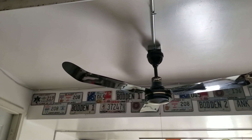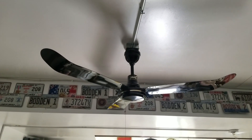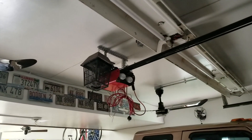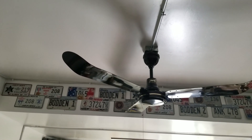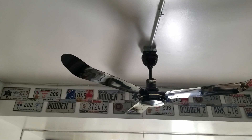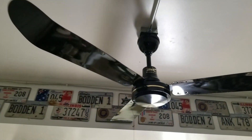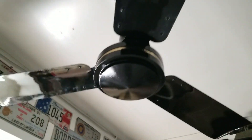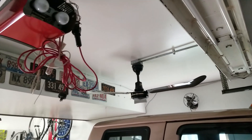I had to do quite a bit of work. What happened is they were left outside and the motors filled with water. One of them didn't fill up all the way — it had a little water in the bottom, so the bottom bearing was toast but the top one was good. Since I was replacing the bearings anyway, I figured I might as well varnish the windings, and I decided to repaint them too. They don't look perfect but they're far better than before. The blades were pretty good — I had to sharpen the edges a little because they were a bit chipped up.